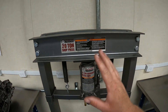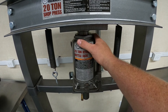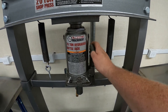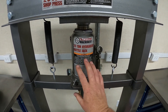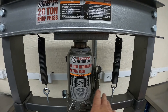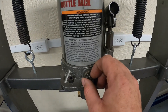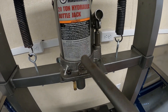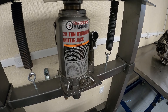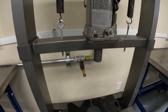This is a very basic hydraulic press. We have the pump here, or the ram, which is basically just a bottle jack that you'd use to lift a car up. We have our hydraulic down - we're actually pushing this ram against the top of the press, moving this entire beam down, and these springs try to equalize it out. We also have the hydraulic release right here, just like a normal car jack where you use the slotted end of the handle and go to the left to lift it back up.